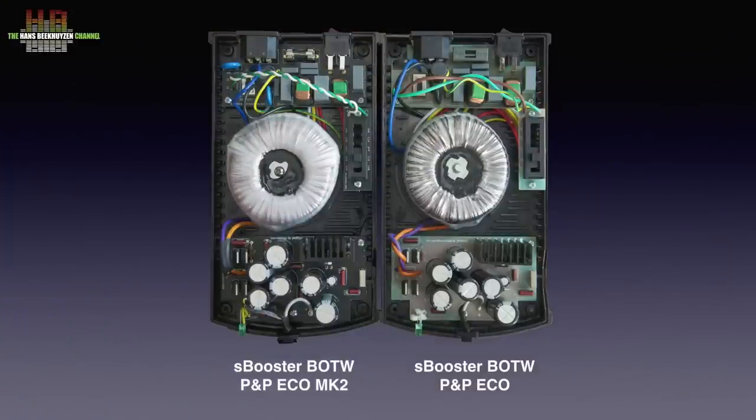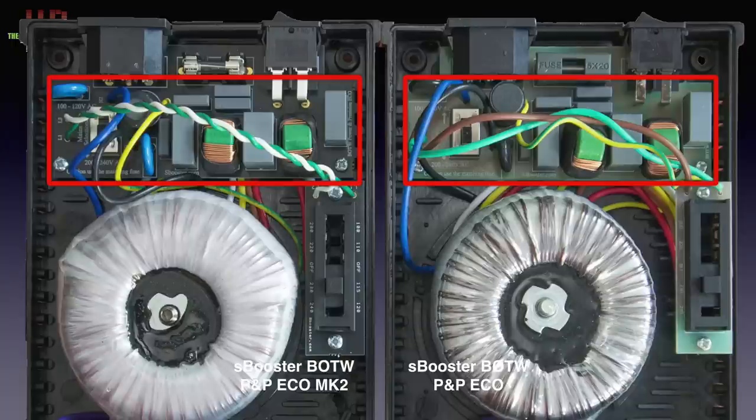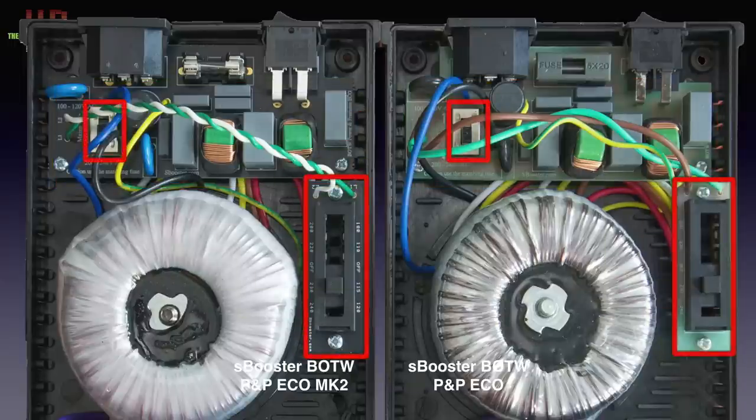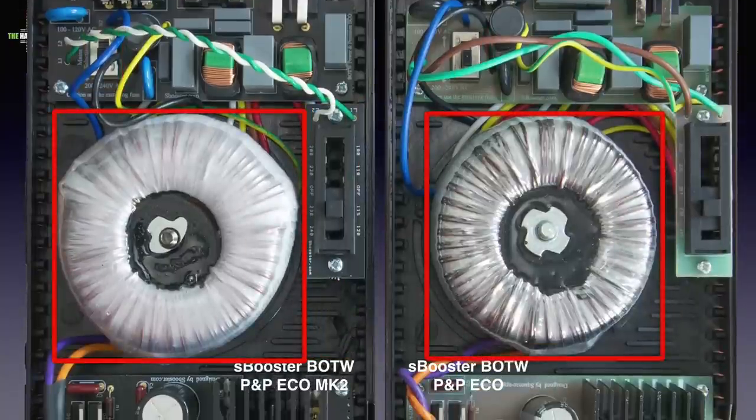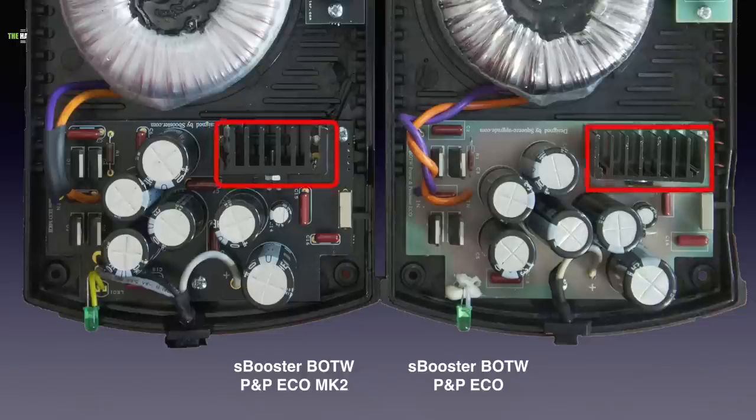The basic architecture of the MK2 has not changed from that of its predecessor. Let's open both and show them next to each other. There is little difference at first sight. We see the power switch and the IEC mains socket directly mounted on a PCB holding the twin-stage mains filter and earth line choke, which clean the input from high frequency pollution. There are switches to set the mains voltage of choice, set prior to shipping with a sticker on the outside indicating the setting. The transformer that follows is a custom-made audio grade toroidal model. The second side feeds the rectifiers, the smoothing capacitors, and the voltage regulator. There is also a switch to select output voltages that are very close together, like 9 and 10 volts or 12, 13, and 13.5 volts, depending on the model of choice.